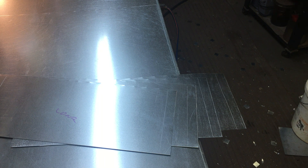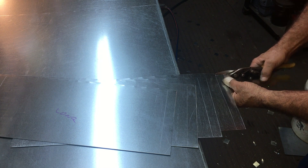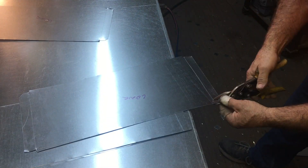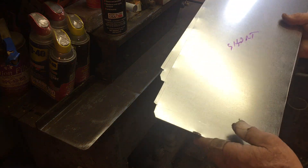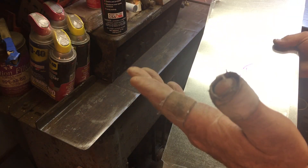Now that you've got everything marked, go back to notching. My son-in-law brought up a good point yesterday — we were talking about these sheet metal videos and he said he was waiting for me to show exactly how you notch them. Remember we have one inch on ends, quarter on the outside edges. So you notch in here right to that one-inch line and take a little dab off just like that. Now we'll take them to the brake and fold these guys — fold those quarter-inch bends on them. No cross-break; you don't cross-break something this small a dimension. We'll put the quarter-inch 90-degree bends on them, then go to the cleat bender over there and bend the drive cleats on the end of them.